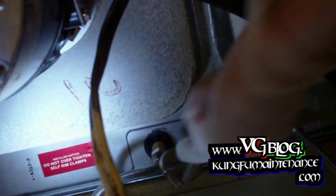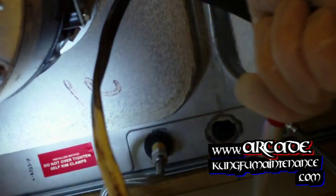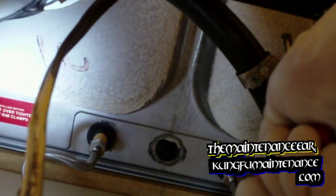And for the hot side, we're going to reconnect our hot supply line. Now with the basin wrench, I'm going to flip it over for tightening mode. Here we go. So we'll be able to tighten it up. Again, sometimes you can get it to catch by itself, but sometimes you'll need your other hand to assist it so it doesn't slip. These, you just want to go a quarter turn past tight, and then we'll leak test it after.